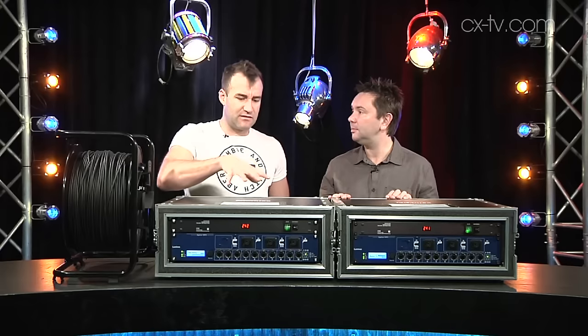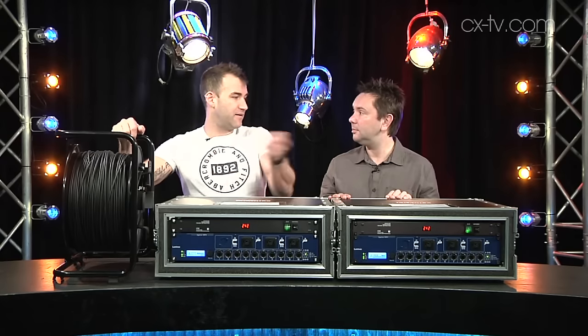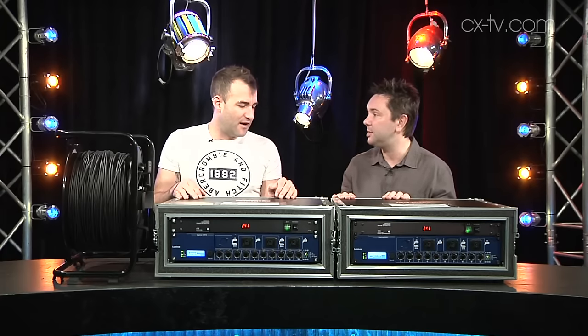It's got its own sort of redundancy built in as far as the data links go. I even tried it with one fiber and one copper link, and then I pulled the fiber and it automatically falls over onto the copper. So it knows how to do data redundancy in the linking as well. And again, you don't need to go in and do crazy configuration.